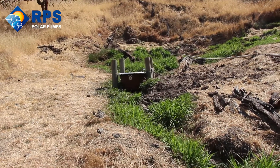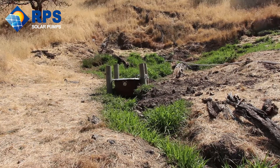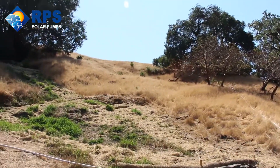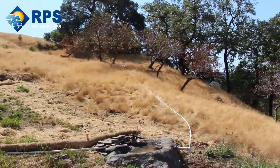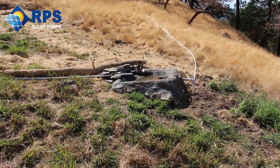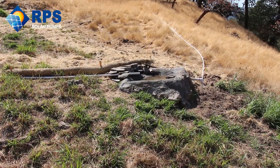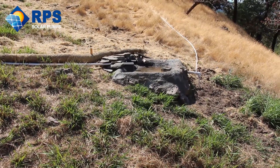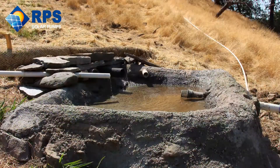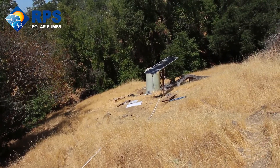You can see one area over here — they're collecting the water from the spring with a little concrete basin. Way up on the top of that hill there's another spring, which they're bringing the water down through a PVC pipe over to this collection area. You can see there's three different pipes running in here, each one running about three-quarters of a gallon a minute. It runs into this nice concrete basin with some local rock that they built up here, then it flows out of here down this PVC pipe and over to that thousand-gallon storage tank.